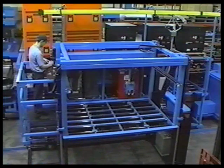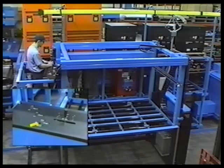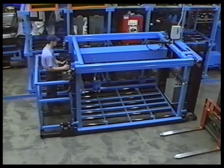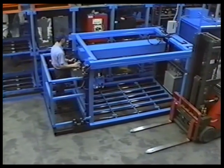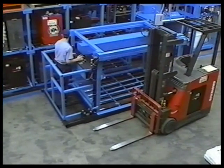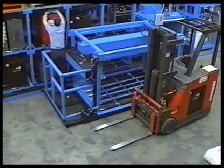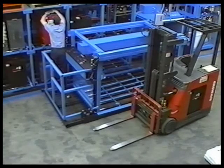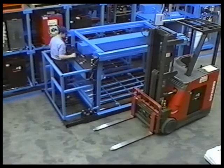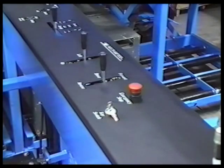The magnet reach retract switch is turned on and the battery is fully pushed into the stand. The operator then uses the travel joystick to position the multishifter vehicle so the battery safety gates could be raised and the battery can be connected to the charger. The multishifter vehicle is now ready to make the next battery exchange. The key switch is turned off prior to the operator departing.